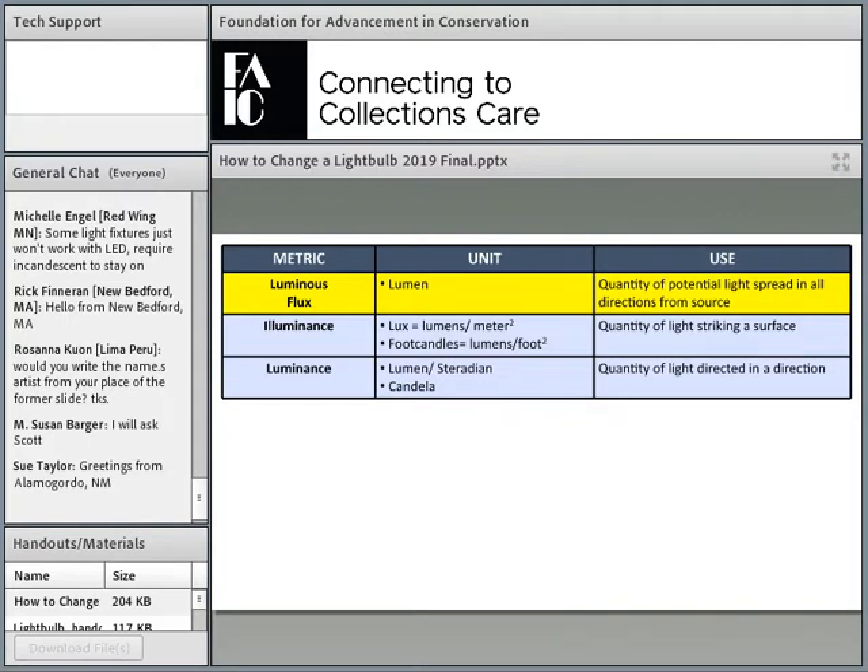I want to get into some of the metrics. When you're choosing lighting sources and looking at catalogs or packages, they'll use all kinds of units and technical names. Let's start with the lumen. A lumen describes how a lighting source throws light in all directions — the potential of that source to create light. The lumen is actually a psychophysical unit: watts integrated with a standard observer. It was developed in the 1920s and 30s. Humans are most sensitive to chartreuse — green-yellow light — so the lumen is largely a measure of green-yellow light.